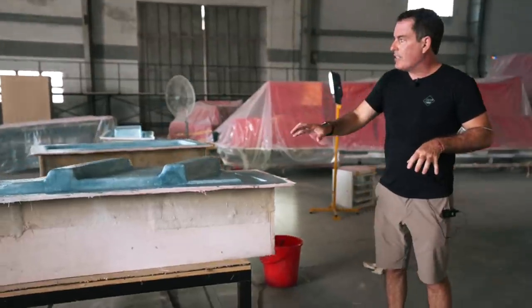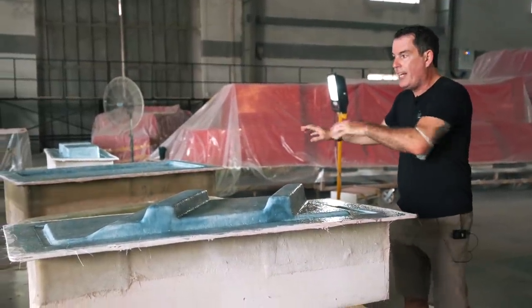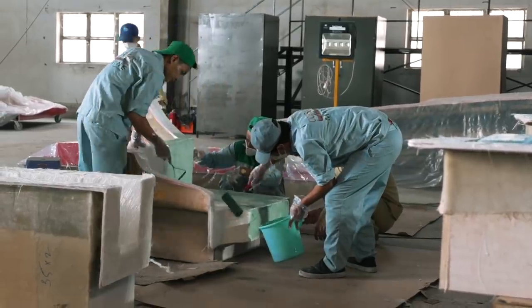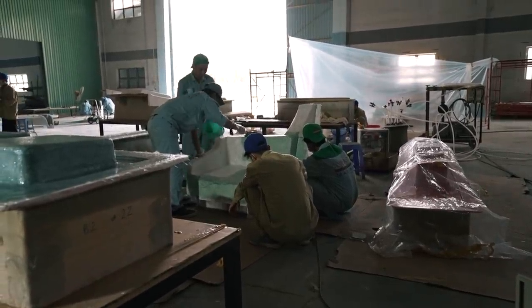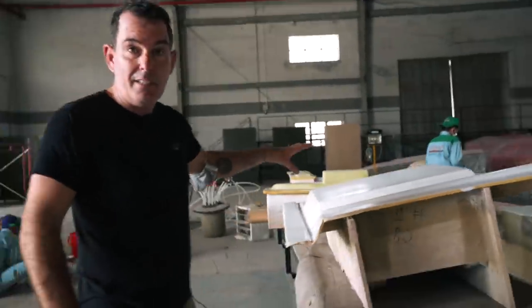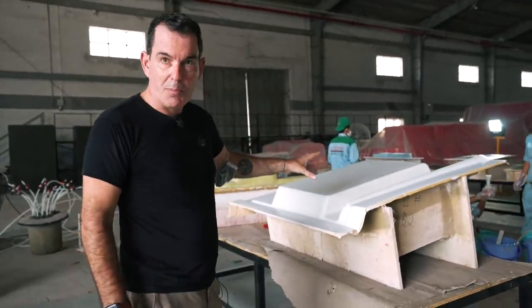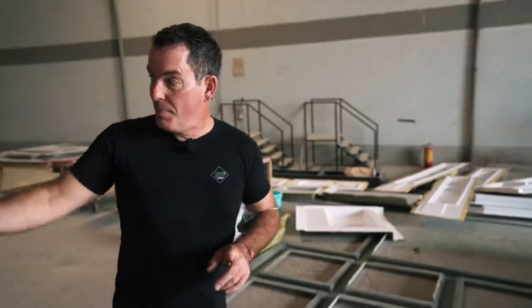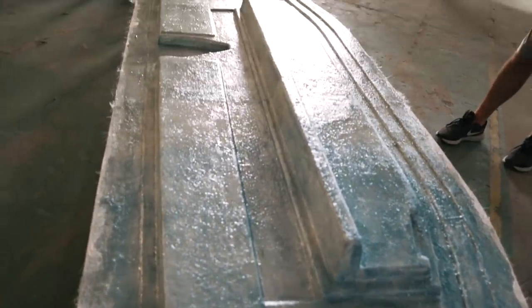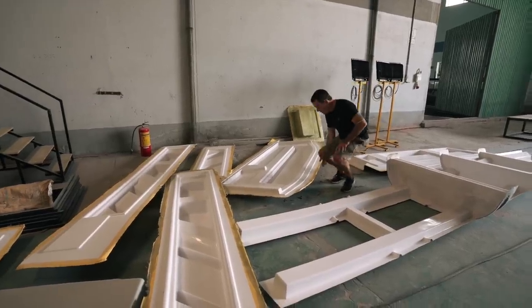Just follow me around — you've got the very processes of lamination. This is all set, then they move down here where workers are doing further levels of lamination on other inserts. And here, gel coat goes on first — that's Part 4A: gel coat spray. Then you've got a tie layer, then you laminate, and when everything's set you end up with the finished part. The part we saw over there with the tie layer is now already fully laminated.